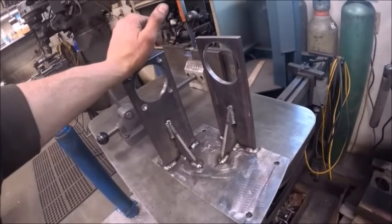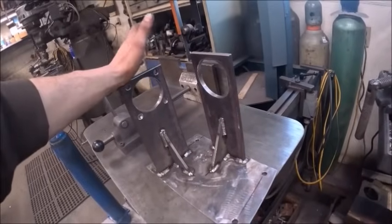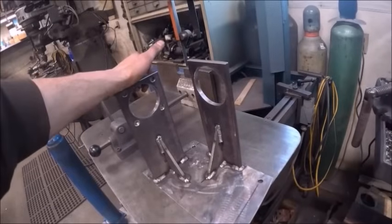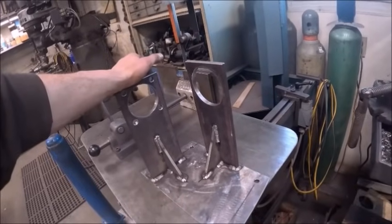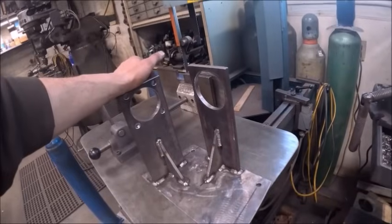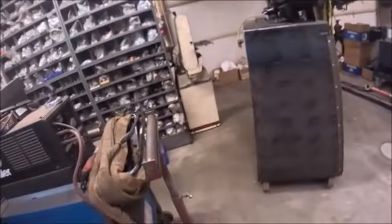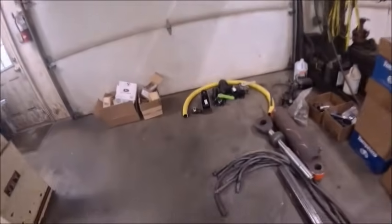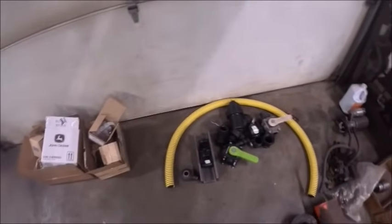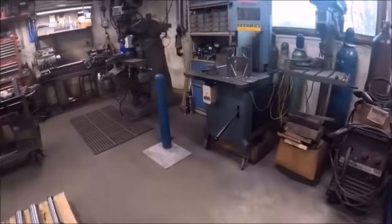And tomorrow we can put all this together. Once this is all on and all the plumbing's on the cart, all that's left to do is weld the new hitch on the cart. My initial thought was to extend the hitch another 12 inches, but for the sake of keeping things simple and compact, I'm just going to cut the clevis off of what's on there and weld this right on the end of the channel iron that's making up the tongue now and call it good. And then with that on, the cart will be done.